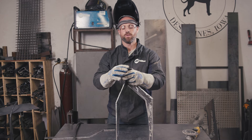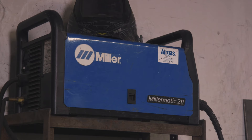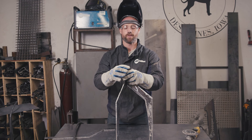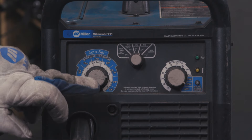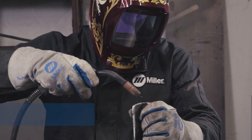So now we're going to take two of the table legs and tack weld the top with my Miller 211, and then we're going to add the third leg and do a slight tack and then adjust the legs before we do the final welds. We're going to go ahead and set up the Miller Matic 211 machine. With the auto-set it's pretty easy — you just select your thickness of material, the wire, and the wire thickness, and then you're all set.